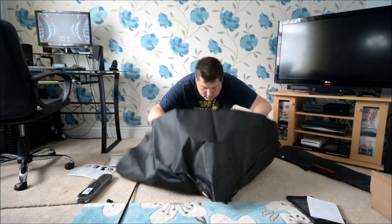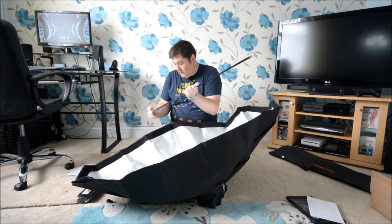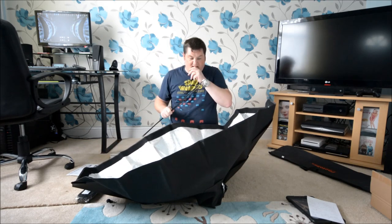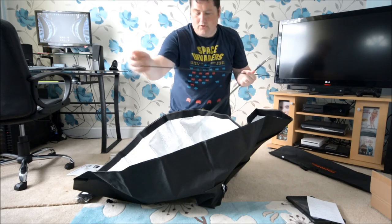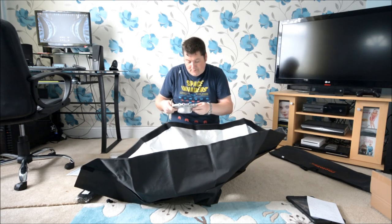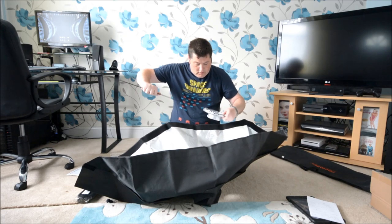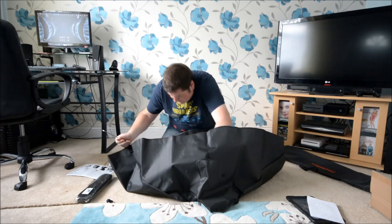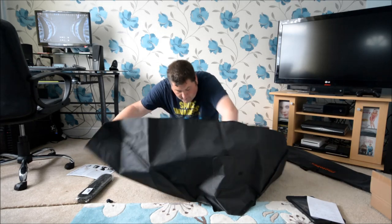Put the ring mount in the centre and get the rods. You need to get these the right way around because with these rods you have a thick piece of metal at one end and a thin piece at the other. The thick piece goes into the holes in the ring mount. They are numbered — it says number two and three for this one. Put the big side in and then just place the small end into the little hole at that end.